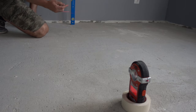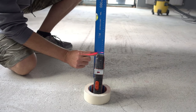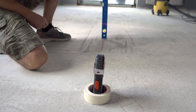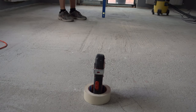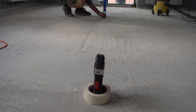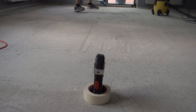That's how much I'm dropping from the center — which is the high point — to here: 0.5. This is going to help do the math to see how many bags I'm going to need. The same rule applies going the other way around. Here I'm at 14, and moving back I'm back to 14. But here I'm at 15, so I have a 1.0 difference over here — a very big dip. Further along I have 15, 15, 15 and a half, and here I have 1.5.